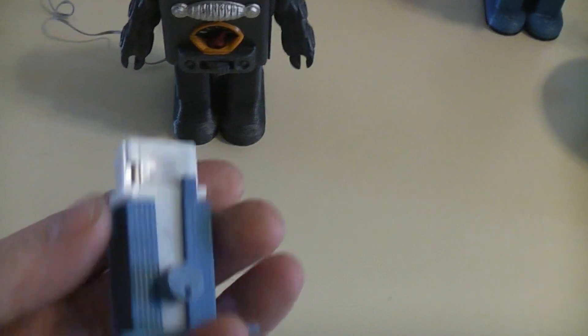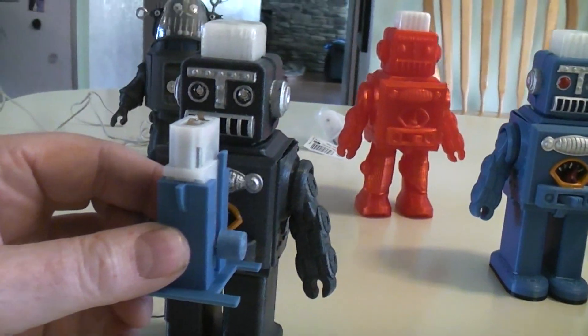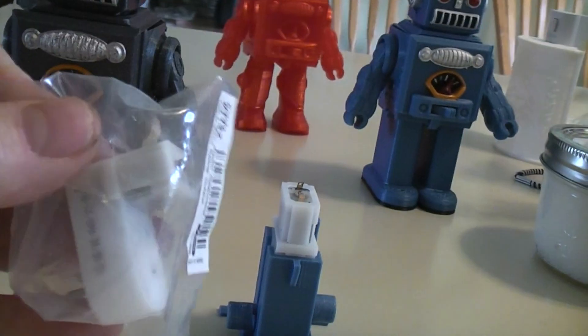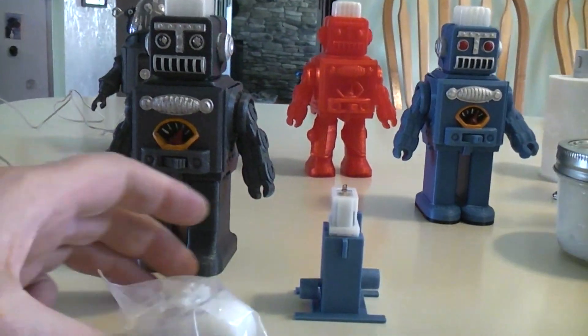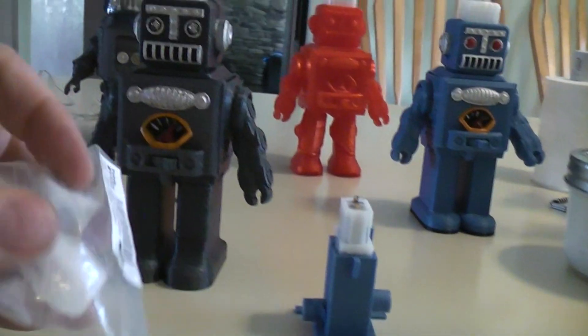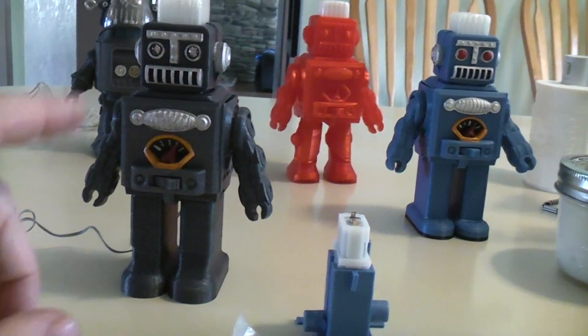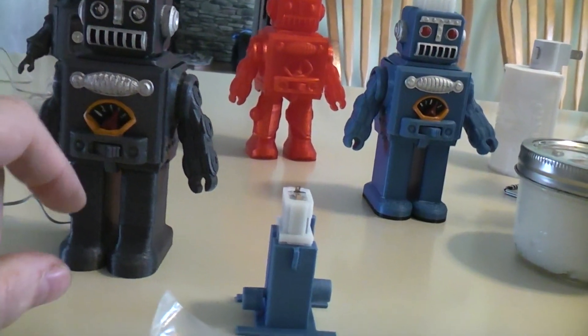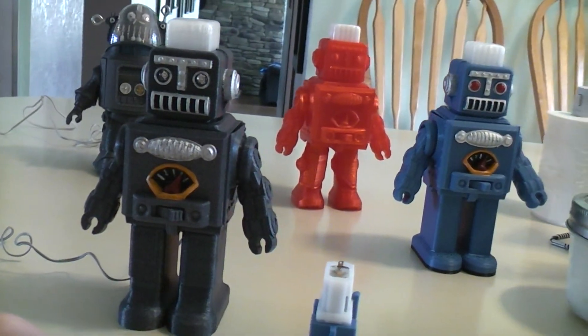Originally I was thinking about using the same vertical motor setup, so I had hollowed out the inside of the head and made it solid so that the motor would have some place to go. But I then decided, because you can get the motor at a right angle also, to go ahead and mount the motor at a right angle so the entire motor would fit within the body. It would have been a little better if I'd gone with a 30% increase, because it would give me more width for the wiring — they're right up against the side of the body right now — but it's all in there. A couple LEDs for lights and an LED up in the head. The head is hollowed out, which just gave me more room to get in there and solder and put the wires in.